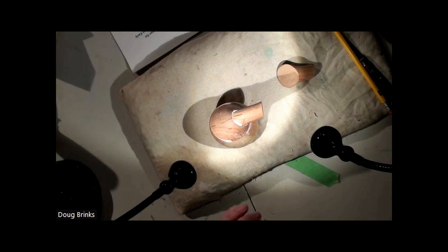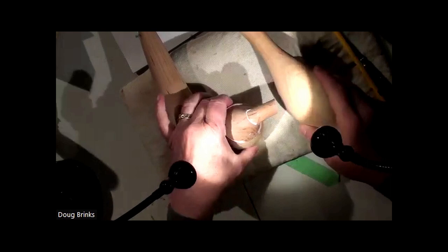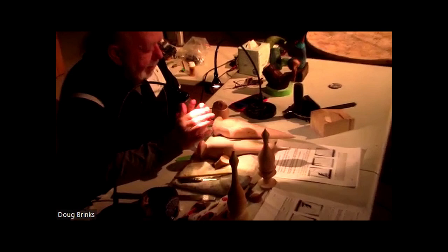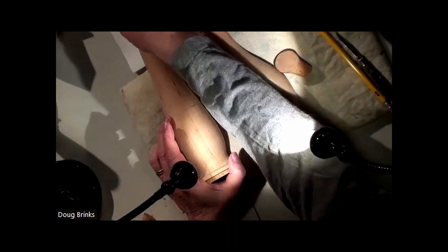The turning of these is about as basic as it gets. Everybody here can turn an ice cream cone or turn this particular shape, okay? It's getting, especially on this piece, the head and the body the right size. It can be a lot of fun, but then it can be totally out of proportion. You can see I've got a line here. I'm not happy with the taper from here, which is going to be the body to the head. Okay, I'm going to narrow this from here out. This is too big for a head, at least for me.